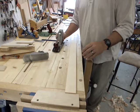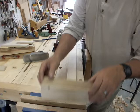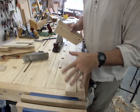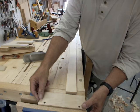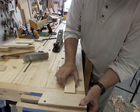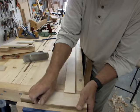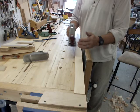The stop — I'll show you, it's in other videos — is three-quarters by quarter-inch plywood. You can turn it either way, clamp it in the vise, and you have an excellent planing stop. It's a lot better than a single little point or a little square one in the bench. Make yourself some of these; get a big surface area and clamp it in. I use the quarter-inch the most. You can raise it if it's too low for a bigger piece. For thinner pieces you need the thinness here. I had it up at the midpoint and clamped it there — you have more surface area. You just need to support the piece; you can clamp tight to the edge or move in a little.